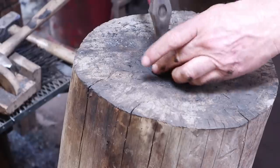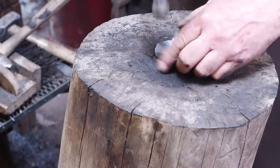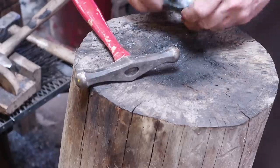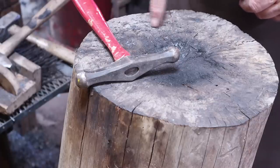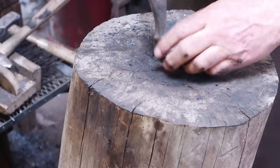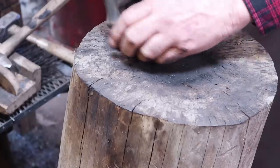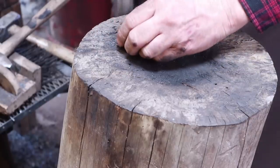Having different size impressions helps as you get bigger. If you're doing a rose with all five stacks of petals in particular, you'll need different size hammers or ball punches and different depressions to work down in. After a while, the small impression becomes the big impression and you make another small impression elsewhere. I always try to do all my square punching in one place because it ends up embedding little bits of metal in there — so if you leave that in one place, you can avoid it for everything else. Or you can have a special scrap of wood just for doing that. A stump like this used for all the things I use it for lasts me about 20 years.